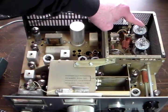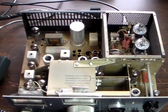These are the finals here — a pair of 6146s. They're not cheap, so I hope I don't have to replace them. The ones in there right now seem to be putting out about 40 watts; it's rated at 100 watts output. We've got a lot of work yet to do — we're going to have to do the transmitter alignment and neutralize the tubes, so I don't know what the final output is going to be from the finals and the driver.